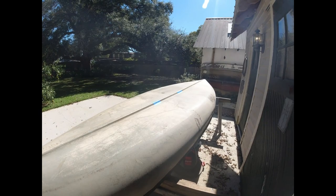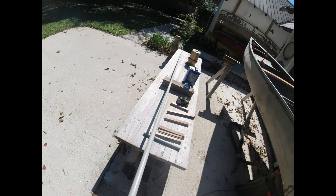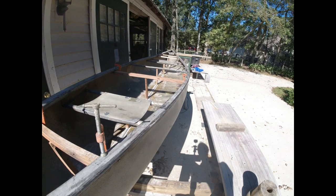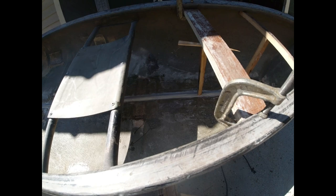I've got some blue tape on the bottom over the holes that go all the way through, so I don't drip epoxy out. I've flipped it back over, got epoxy down the middle in the crack, and rough-sanded my piece of conduit. I'm setting it in there now. We have our PVC conduit down the middle, bedded in thickened epoxy.